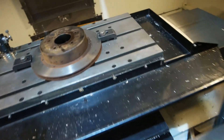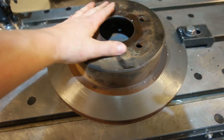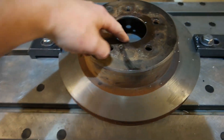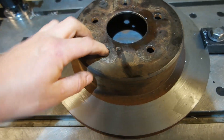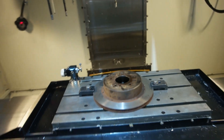Now I probably could have just drilled them by stacking another 4-stud rotor on top and drilling straight through. That's what people usually do, but I've got access to this gear and it's probably a bit more accurate doing it this way. Ultimately the hub picks up on this center bore here so if the holes are a little tiny bit out it doesn't matter, but why stuff around when you have access to gear like this?